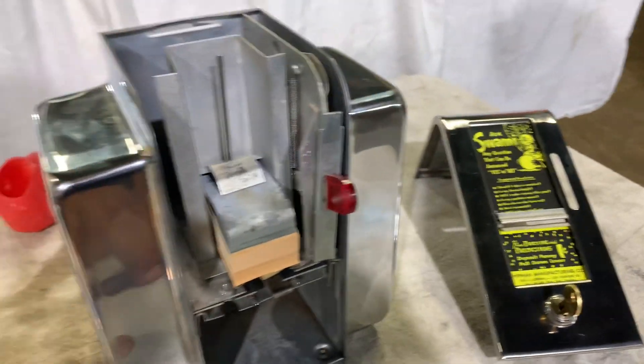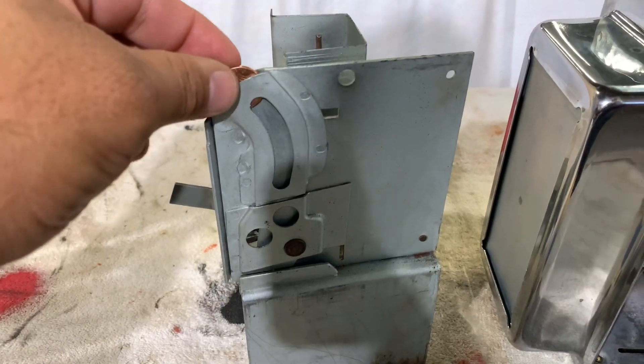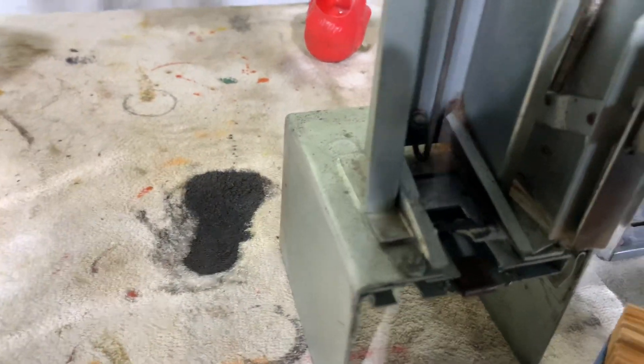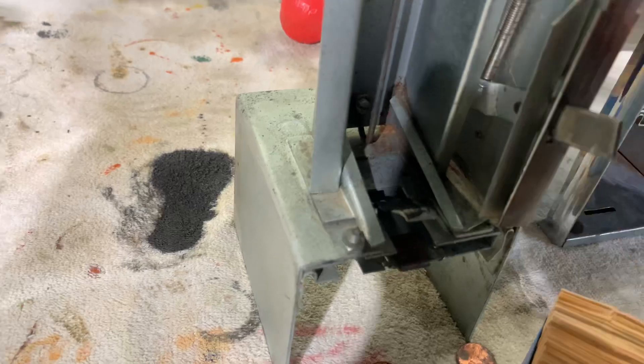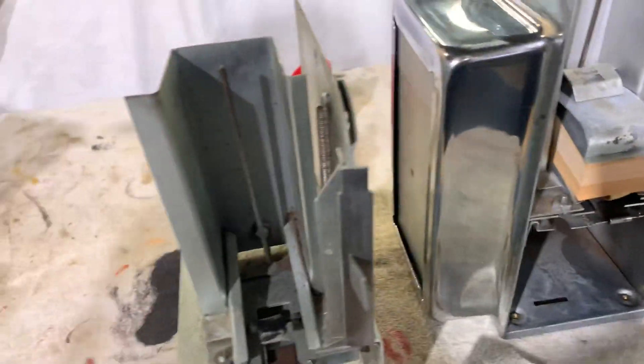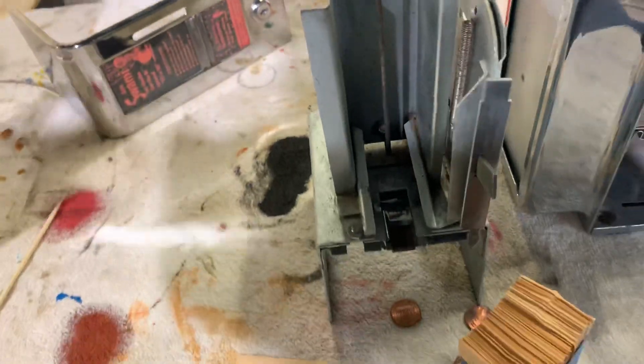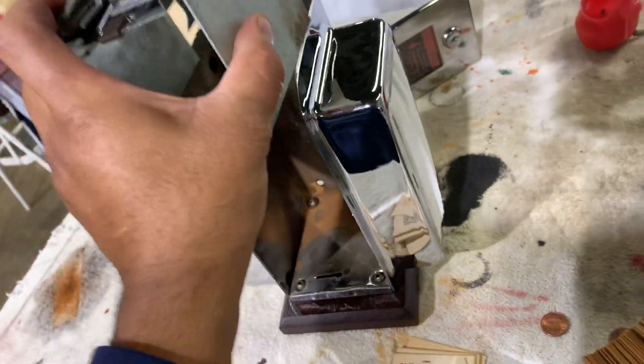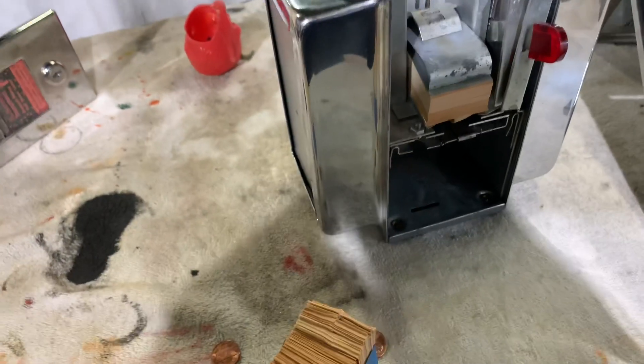So how does this machine actually work? As you put your penny in, it falls into the slot, and as I push down you'll see it pushes forward and kind of kicks it up — the penny just drops to the bottom. The machine itself just sits inside; there are no screws holding this mechanism in. It slides right in place. So when you need to clean a rubber band or add fortunes, if you can't reach inside, it easily comes out.